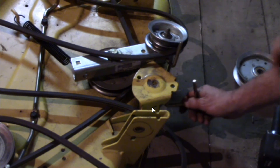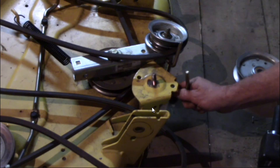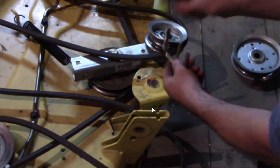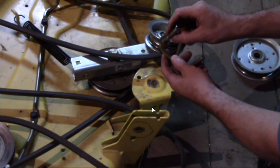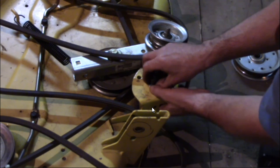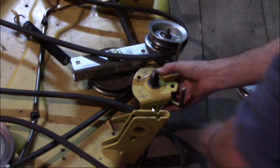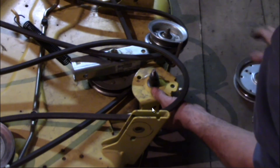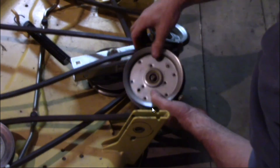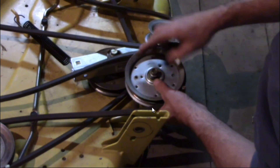I put this pulley back together, adding a washer underneath. Add a washer and then put that shoulder bolt on — this will solve the problem, at least it did in this case. This deck hasn't come back, and just that little bit of washer added underneath that shoulder bolt did the trick. It doesn't break belts anymore. He's used it the whole season and it hasn't been back for a broken belt.